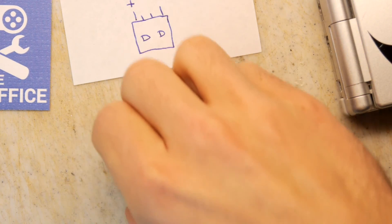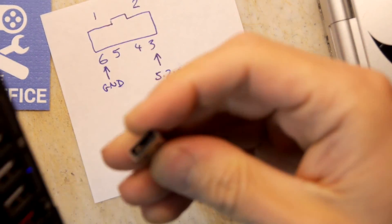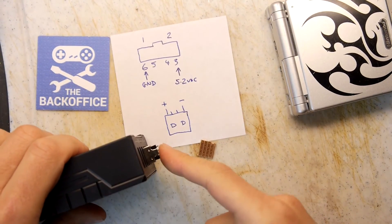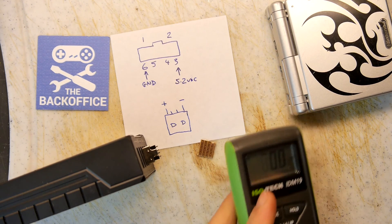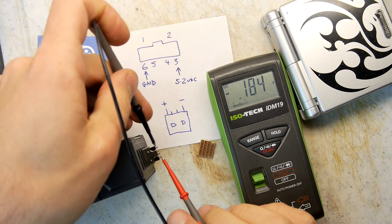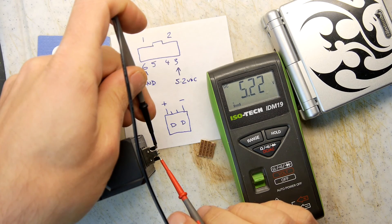So if you've got one of these, I worked this out by plugging the USB connector into a PC and buzzing it up. I just literally plug it into a USB connector like that — pretend that's in whatever your power source is, could be a computer or something else. Then get your multimeter and put the probes on the two outer pins, because those are the ones we're really interested in; we're not interested in the data lines.